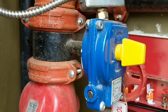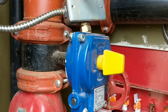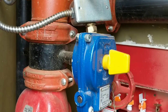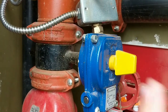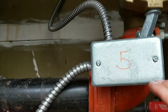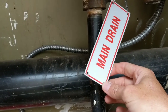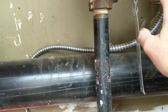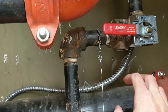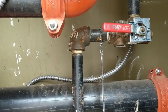After my control valves are shut down, I want to go ahead and drain my system — this is where you have to be careful. If you know you have an interior head, let's say you have two systems: I have a wet and a dry system. So I want to find my water line going into my interior heads. I can find the main drain for my interior head system, open that drain valve to allow all the water to drain out, and that'll stop the flooding units.